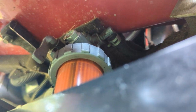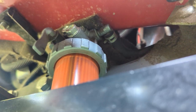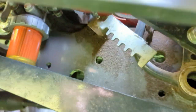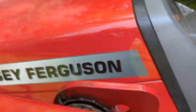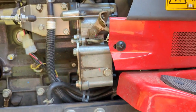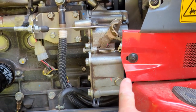Number three is in regards to the fuel filter. I'm really confused on what the procedure is for changing the fuel filter, because the manual says after you change the filter you need to bleed the line. One of the bleed points is one of those screws you see there, and the other bleed screw is on the engine somewhere — I still don't know exactly where it is. Redneck Ed had a bit on that and I need to look at that again.